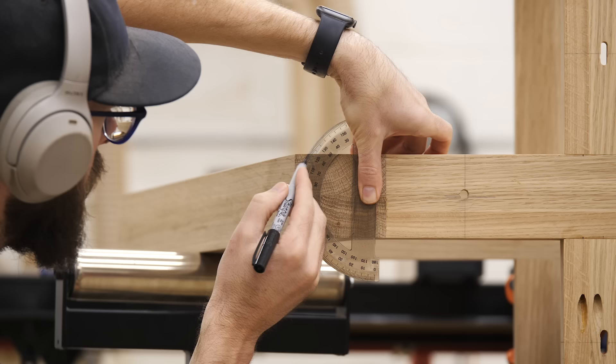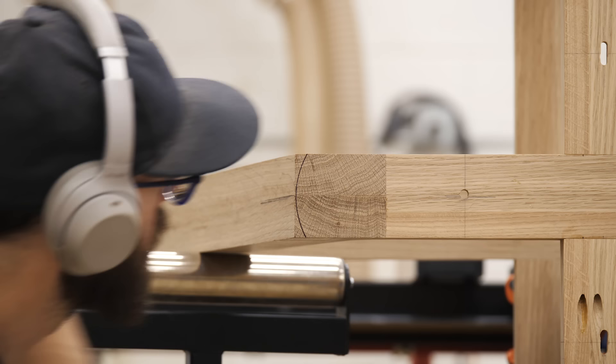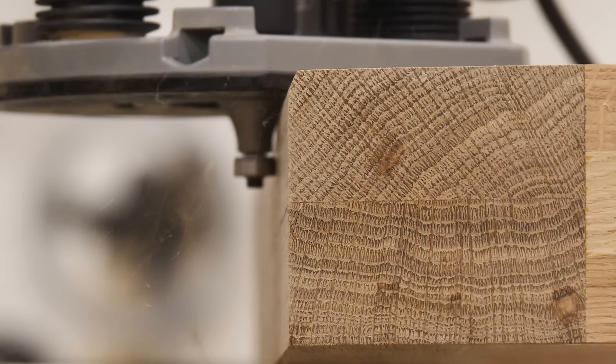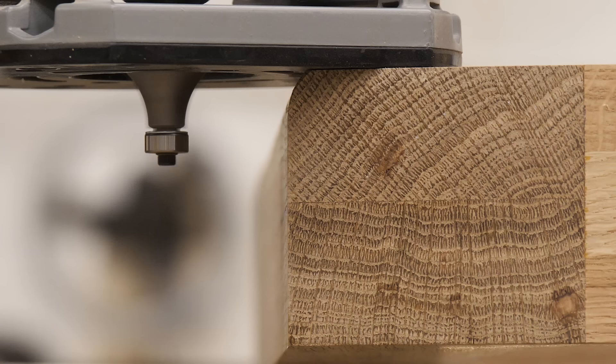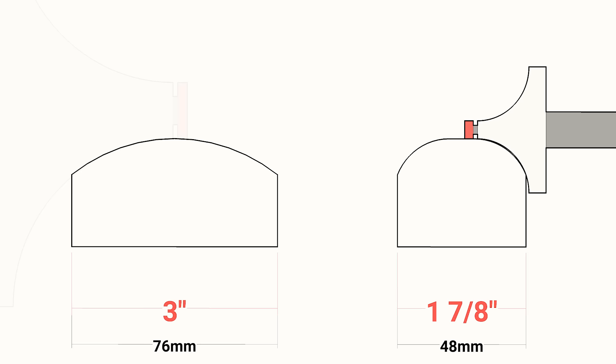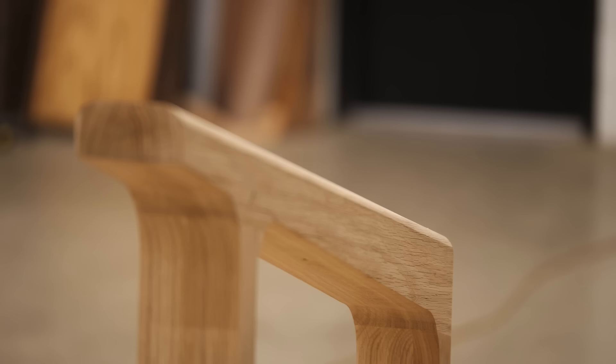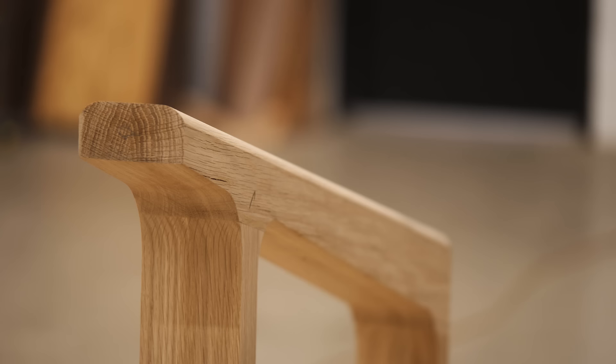Next, I started working on an optional edge detail for the leg, which was probably the most disappointing part of the build for me. I wanted to use an edge detail we always describe as a thumbnail profile — round on the back edge but still with a nice crisp edge on the face. We cut this with a normal roundover bit. If you're doing the thinner leg version, it's really simple to get this shape. But with the thicker version, the roundover bit would have to be gigantic to get a nice smooth arc. Instead, I ended up with a large flat spot on the back. But at least I still got a nice crisp line on the face, so while it's a little disappointing, I'm still pretty happy with the effect.